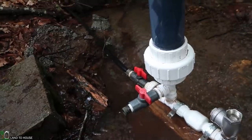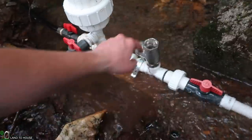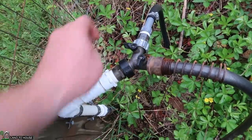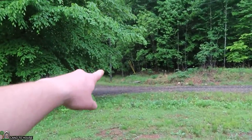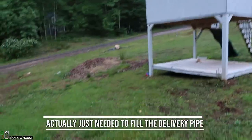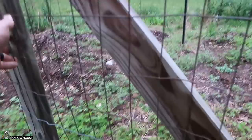I think what's happening is I need to go close a valve at the garden. There we go. Basically, the water was going up from the ram pump in the creek, way up the hill, coming back down and going to my little sprinkler over here, and that was preventing the ram pump from cycling as it should. So we are good to go now.